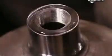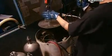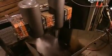To be tested, the cylinder is filled with water, then it's sealed off and immersed in water. The machine then adds more water to the cylinder and gauges how well it withstands the extra pressure. The inside is rinsed with hot water, then dried and cleaned with purified air.